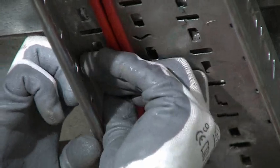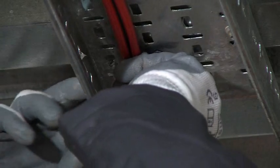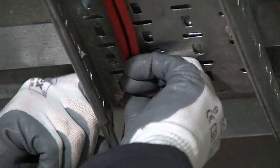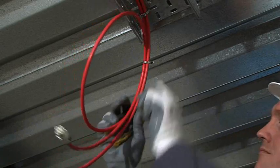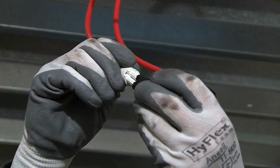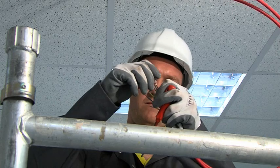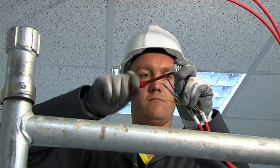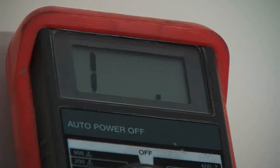As with any cabling system, fixings should be spaced at a distance to comply with industry standards. As with the traditional system, once the cable is installed, any excess length can be taken up by forming a helix. The loop test assembly is installed during the first fix stage, making mandatory cable testing quick and easy. When compared with the traditional method of using connector blocks to facilitate cable testing, SmartFix Plus offers an impressive alternative in a fraction of the time.